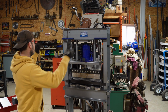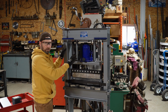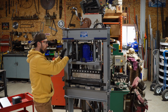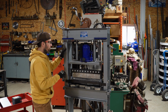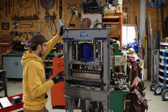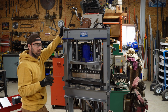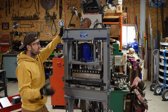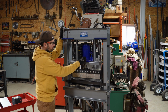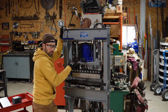All right, so other than those pulleys being garbage, next big dealio for the brake itself is the air over hydraulic. This is a Vevor, V-E-V-O-R, right off of Amazon. It was $120 shipped to the house. And it's a 32 ton. Now there was a lot of mixed reviews on it, leaking or didn't work, or I checked it all out. I've rebuilt a couple bottle jacks before, and as long as it's got good oil and all the seals are good, it should work just fine.